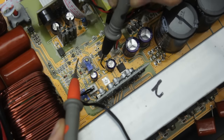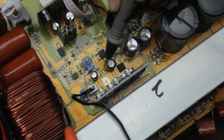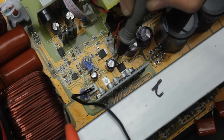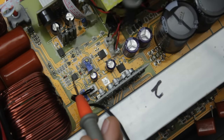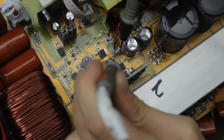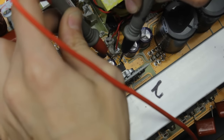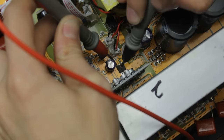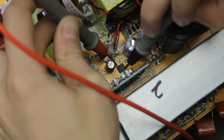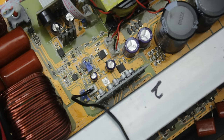The first thing I'm wondering, and probably should have checked first to be perfectly honest, obviously this 7805 is being supplied by this 7812. It's just converting down to 12 volts and then further converting down to 5. So if I had had all my brain cells functioning, I probably would have checked the output of the 7812 first before removing the 05, because it appears that the output of the 7812 does have the short on it as well. So that's the next one to remove.